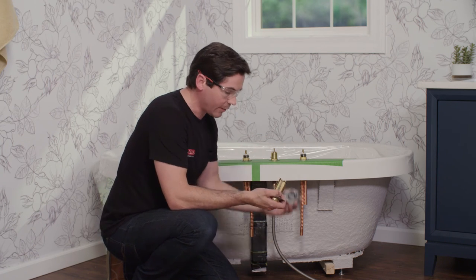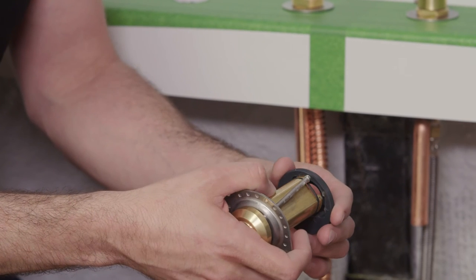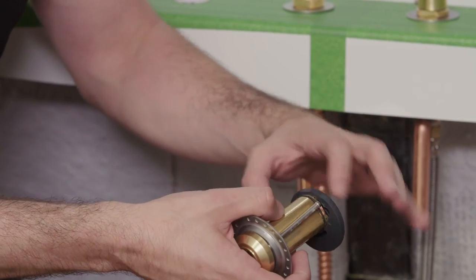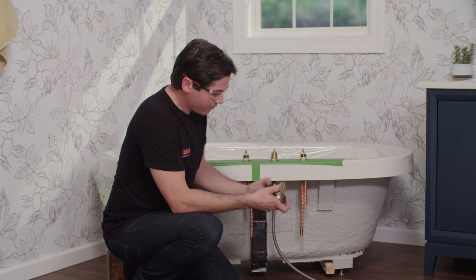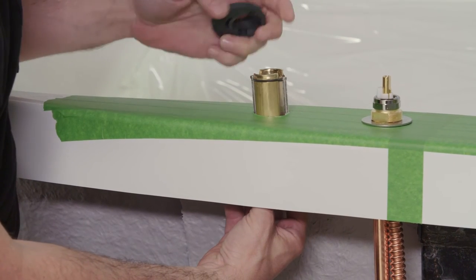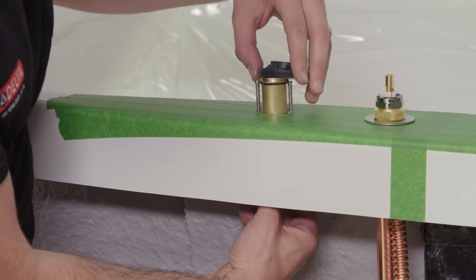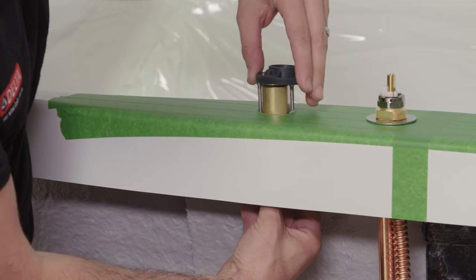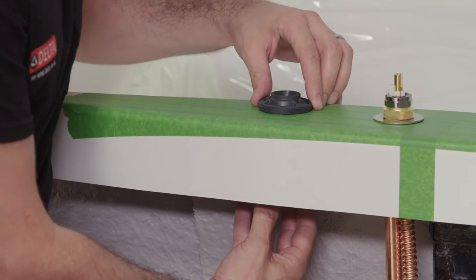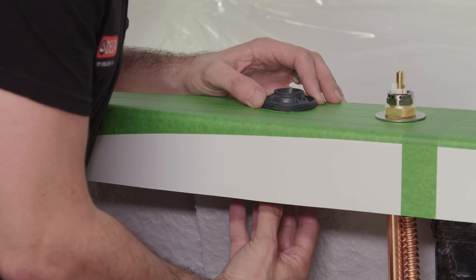The hand shower nest mounts the same way as the others — pull it up from the bottom and reattach the cap. In the bottom of the plastic cap is a keyed opening where you move the nest body into the opening and turn it 90 degrees to lock it into place, so the holes on the bottom of the nest cap are even with the jack screws. Put the nest body up from the bottom, insert the plastic cap on top so it nests down into the key, turn it 90 degrees to lock it in place, and drop everything down onto your deck.